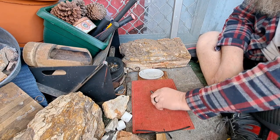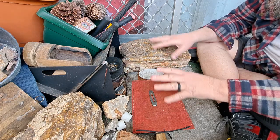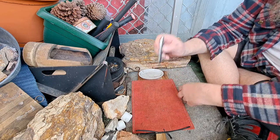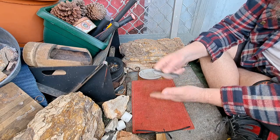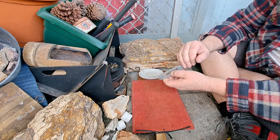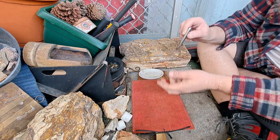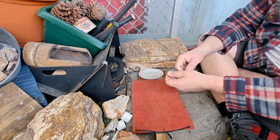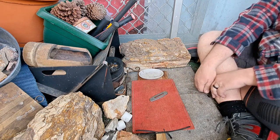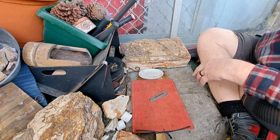Anyway, I hope that helps. To recap: bright orange, non-magnetic, straight into water, swish it around, then straight out onto the grinder. Grind it all the way around, soften all the edges, keep it cool, then onto the wire brush. Clean it all up and you'll have a really nice striker — they turn up really well. Thanks for watching.